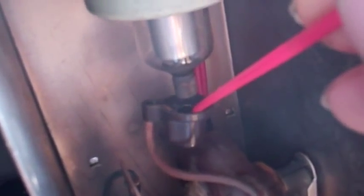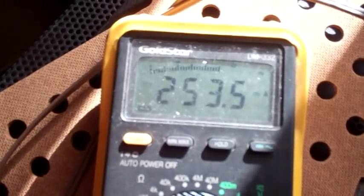You can see how weak it is, and if I pull it on or off it still stays the same. It's hard to believe this would go bad — this thing is like new old stock. It's pretty hot today; the temperature inside here is 98 degrees and the temperature of the flyback is 203 degrees, and it got that hot really quick.